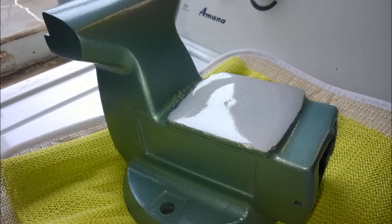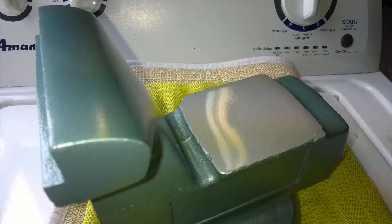Well, look at that. Amazing what a little paint and body filler will do for you — look at that nice green shine, that silver on the anvil, a little clear coat on top. One thing I'm going to do is actually polish the anvil, just to make it a little more scratch-resistant. I'll do a little 2000-grit wet sanding, put a small polishing pad on the Dremel, get some rubbing compound down there, and smooth it out. It's already looking terrific.